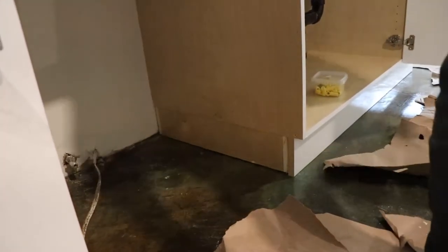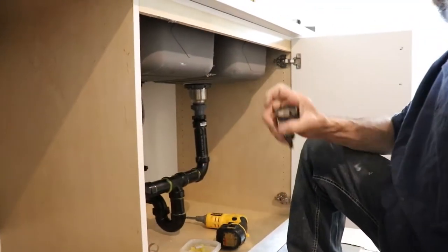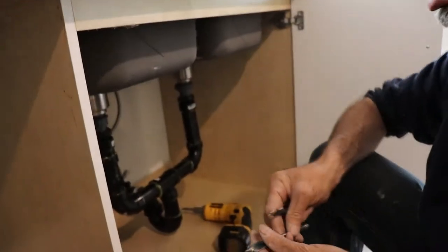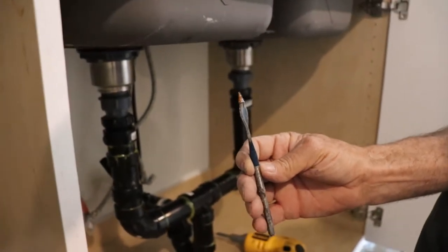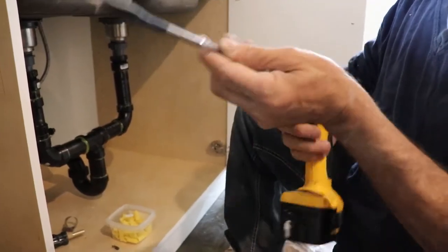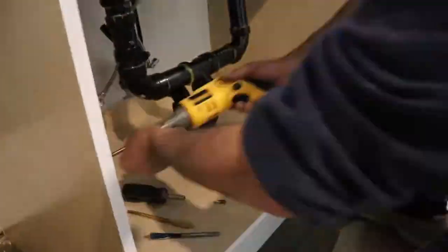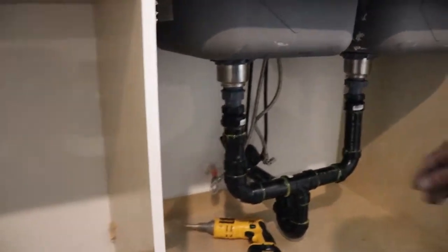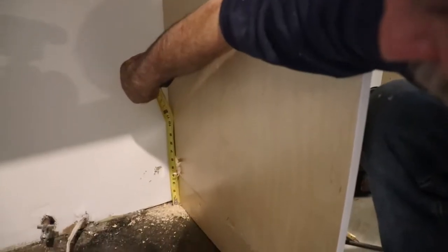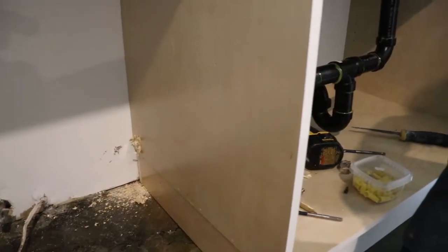We get a drill. I could use a drill and a hole saw — it would be way faster. But I'm just gonna show you something: I have these small drill bits. If you don't have the drill bit you're looking for, something like that would do the job. I have the drill but I'm just gonna use this screw gun — I put the drill bit in there, fit it in, and it just works. Once I have that I'm just gonna knock it off with a hammer or use a hole saw. I'm just gonna take my measurement to see if I have to dig a little bit more inside the base — yeah, I'm gonna have to go a little bit deeper inside the base, otherwise I would not have clearance for this pipe.